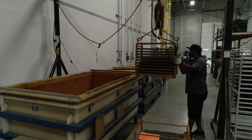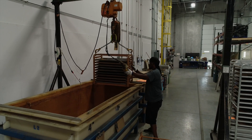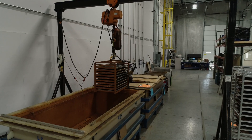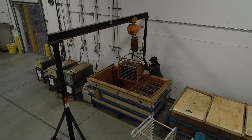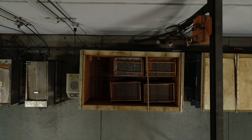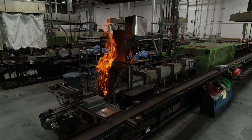One of those stages is solvent extraction where we take the binder out. The system that MPP is currently using dissolves the binder system in water. We put the parts into water and much of the binder comes out, but some binder is retained so that the part doesn't lose its shape. After water debinding, we take the product into an oven to dry out the moisture.